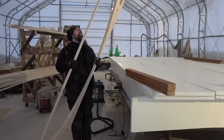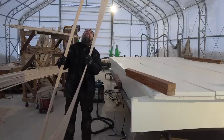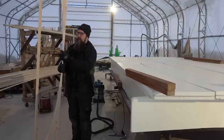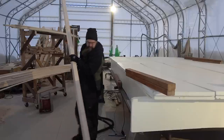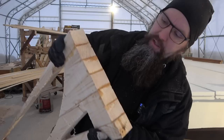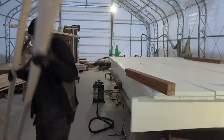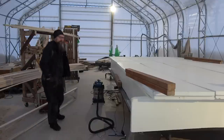This one didn't go actually that well. I made a little bit of a shortcut and I did not plane the gluing surfaces down before doing the glue up. So they were in the surface, you buy them from the hardware store. And there was a small issue in that somewhere you can maybe see there's a bit of a gap here. It is glued very solid, all right, but there is still some kind of a gap there. So I'm gonna prevent that and plane those stock pieces before a little bit to get really straight and smooth surfaces for that.